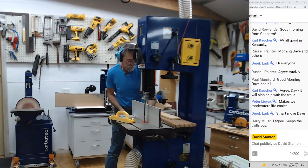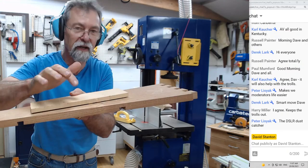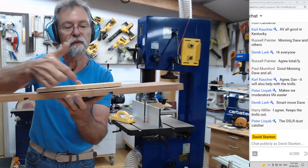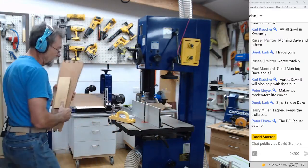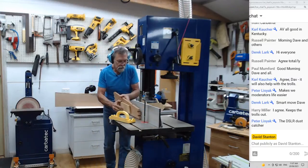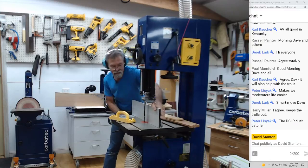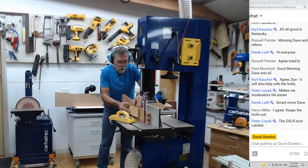Now I'm going to bring this over. You might notice I've left about a 2 millimeter gap in the inlay, and I'm going to do a video on how to do this. I have started doing videos again. You'll notice I did the weight loss thing. I did some other videos earlier. I'm slowly getting back into it, but there is that gap there, and that's to guide, or kind of guide, the bandsaw blade. It works. So I can come back just a little bit further. The main thing is to not, I repeat, do not cut into the red cedar part, because that would be terrible.